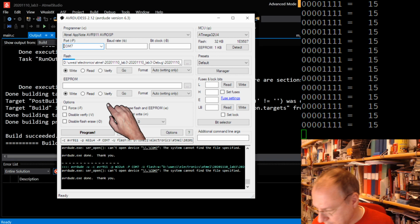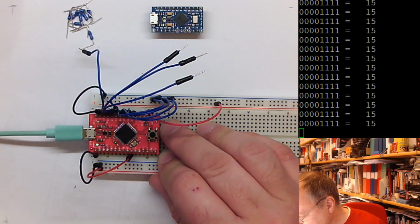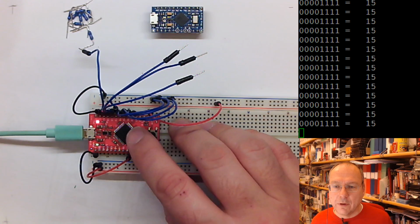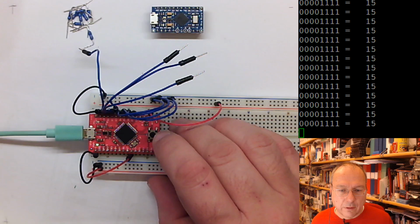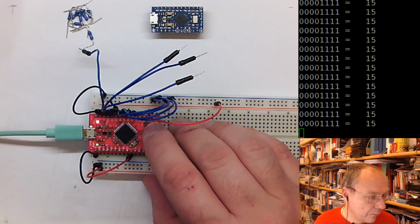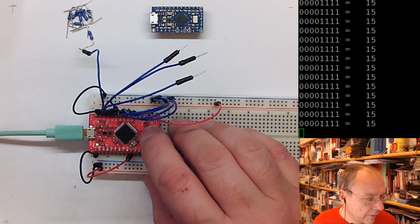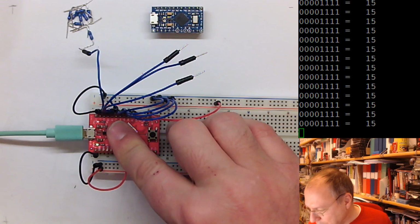Okay. I have no idea why it hung. I will disconnect from the USB and reconnect the USB cable. I will then give it a reset. It shows that it is in bootloader mode, but for some reason COM7 doesn't show up. I'm confused. This never happened yesterday when I tested all the code. It is in bootloader mode, but the COM port doesn't show up on Windows. Okay, let me try a different USB port.